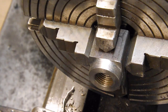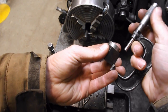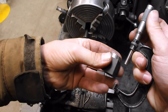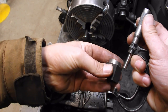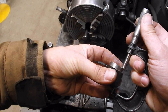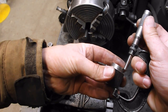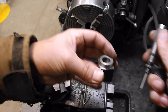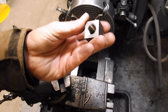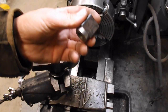So I'm going to take that out of there and see what it looks like on the cylinder. Now that the part is out, I came into that one and I moved like half a thousandths. And yeah, I'm within a thousandths — I'm really tickled pink with that. Very happy. So let's go put this on the cylinder.